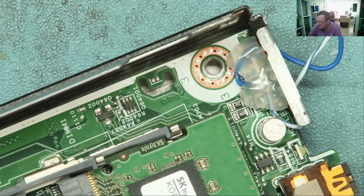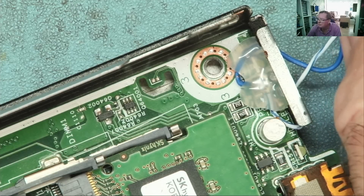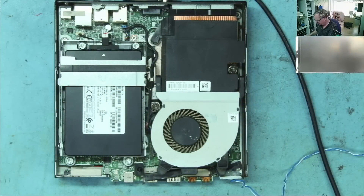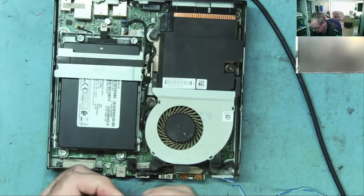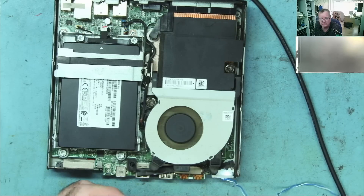The other reason for the hot-melt glue is to make it difficult to rip the pads off the board if someone pulls the wires. You can call this a bodge job if you like, but it's probably the easiest way to get this thing working for the moment so the customer can use it. You can see the screen there — it's a bit like hotwiring a car. The light flashed — got it!